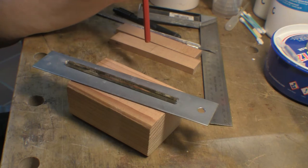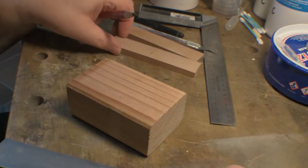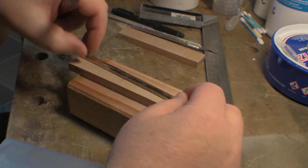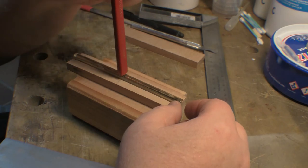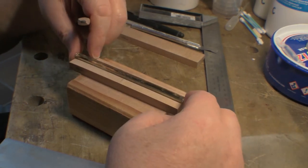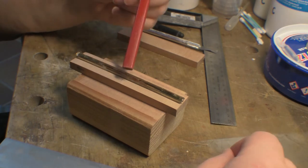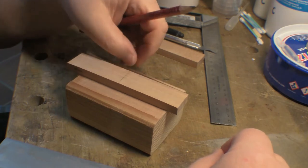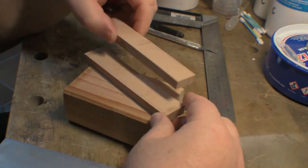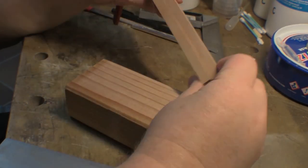Having spent a fair amount of time trying to figure out what to do, here's what I came up with. For one half of the mold, I've sanded a curve which matches the upright, so that it's fully supported all the way along. I then put sticky sandpaper on here and sanded the opposite form, so that these two pieces fit together with no gap in the middle.